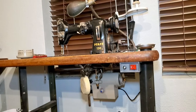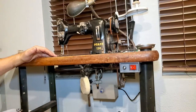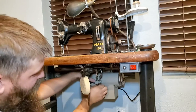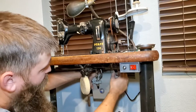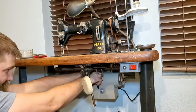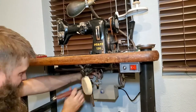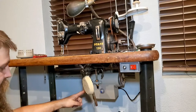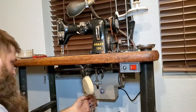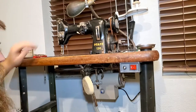I've got the motor mounted. I had to make the belt just a little bit shorter and now it fits. You should just be able to lift this motor up and set it down, then loosen it until you got enough belt tension, and this one will tighten right down on top of it — that's what gives your belt enough tension. Last thing left to do is get this motor control hooked up to my foot pedal, then plug it in and see if it works.